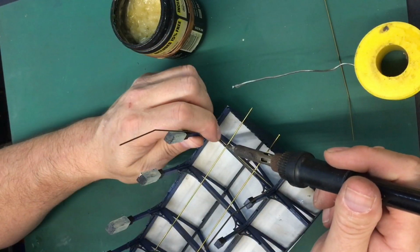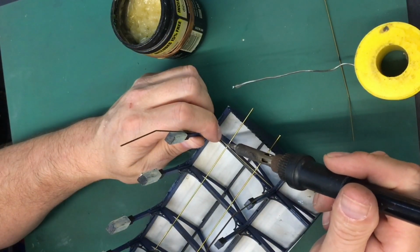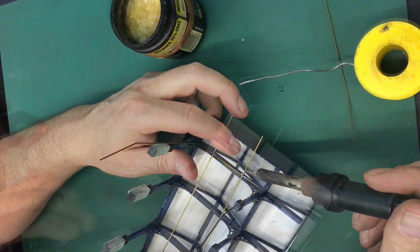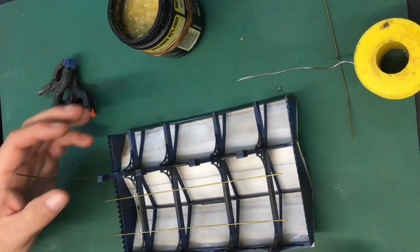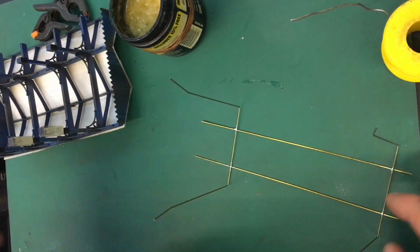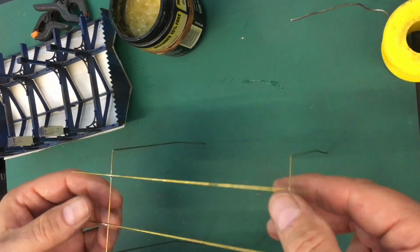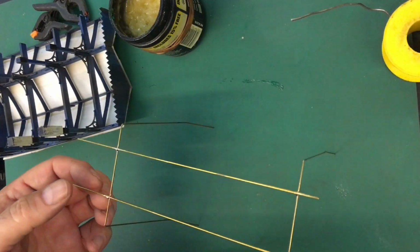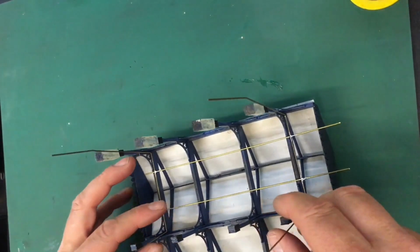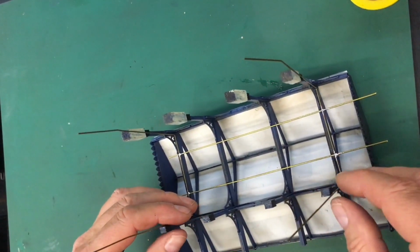At this point, it's very key to get a strength in the framework when we're adding the LEDs, and then we'll adjust it as we go on. Now just soldering, just using flux and normal solder, and just doing each corner, and there we go. That gives us our structure. As you can see, it's like a little H shape with legs, and then at this point we will add our LED lighting.